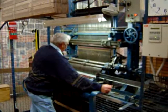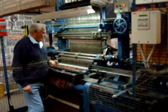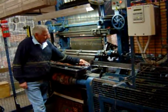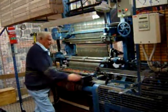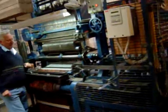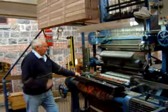Cross goes the weft needle, caught by the shuttle, and again we've left behind the binding weft. Again, our grippers are still locked. There's the yarn. They won't unlock, of course, until our needle is out. We've unlocked and left the yarn behind, and another row has been woven in. So it's simply this: lock, cut, unlock, lock and cut, unlock.